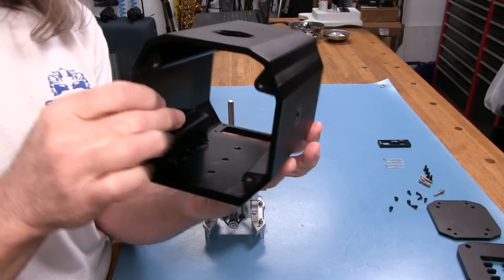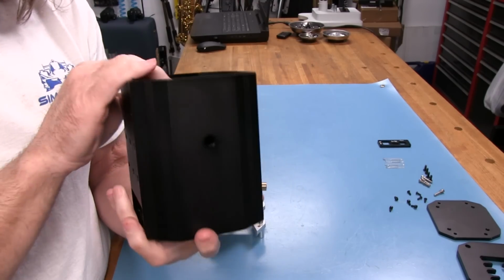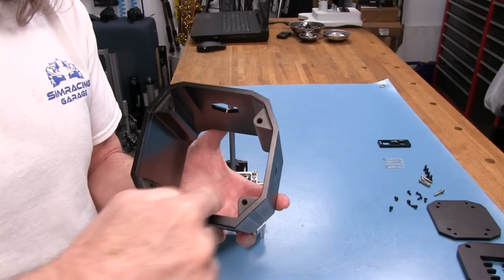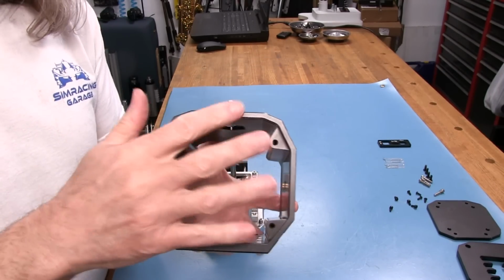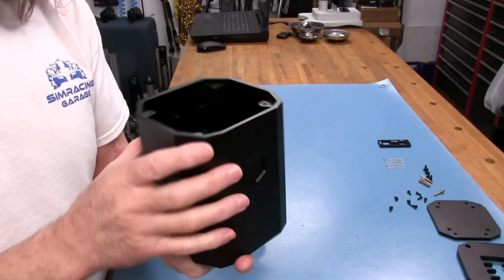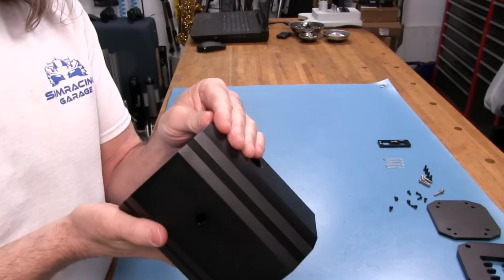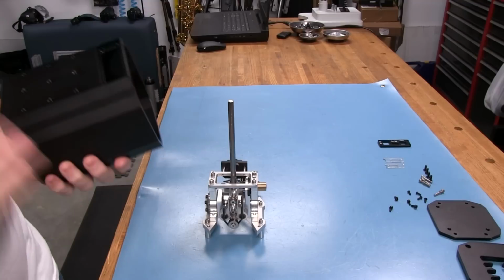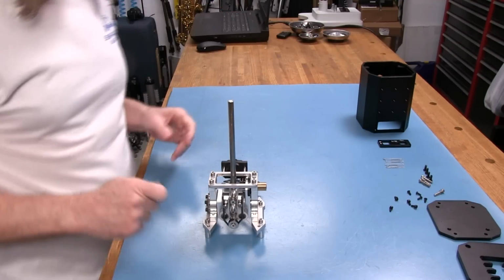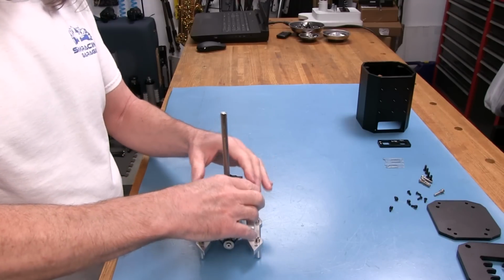The coating is uniform outside and in. There is no exposed silver that you've seen in a lot of casements. When you take them off, it's like they sprayed some around here, so it looked good from the outside, but when you pull it apart, it's all silvery inside. I can't find anything like that in here. So yeah, inside and out anodization usually is an indication of a quality production process. Let's take a look at the assembly itself. We'll talk about the circuit board in a minute.